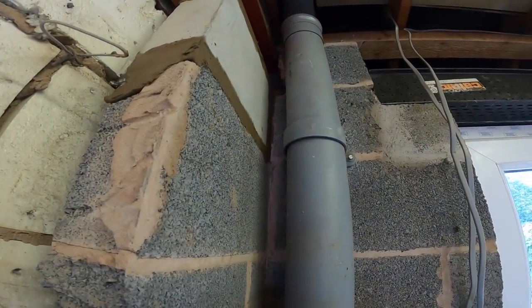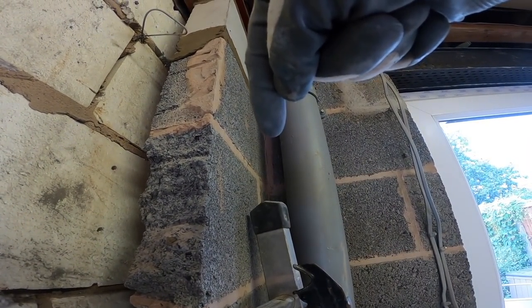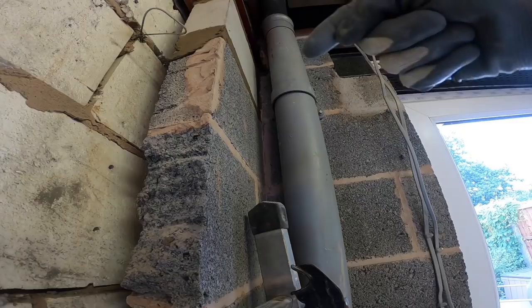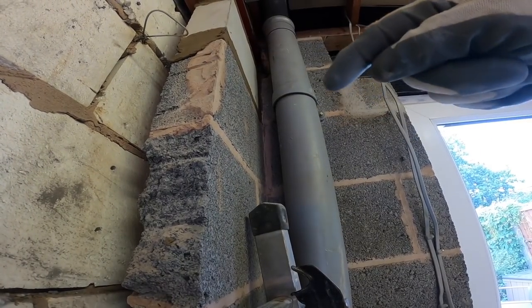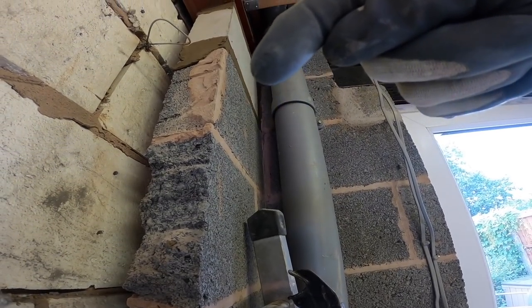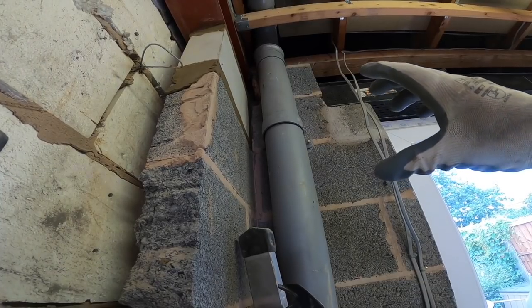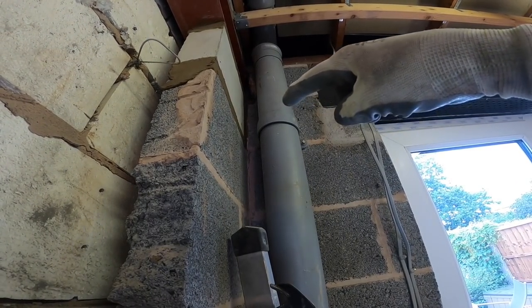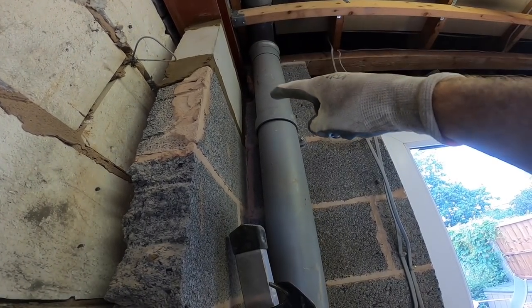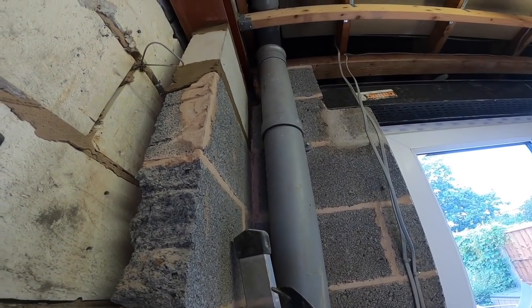I didn't take the pad stone right through because that block there, this one here, bonds through. So if we cut that off, then you'd have this block. No, sorry, this block and the pad stone. That would be bonded into this corner, so that block is giving the corner strength. So that I've got the pad, and then I've pointed it tight underneath that lintel as well, steel, which you saw in the time lapse.